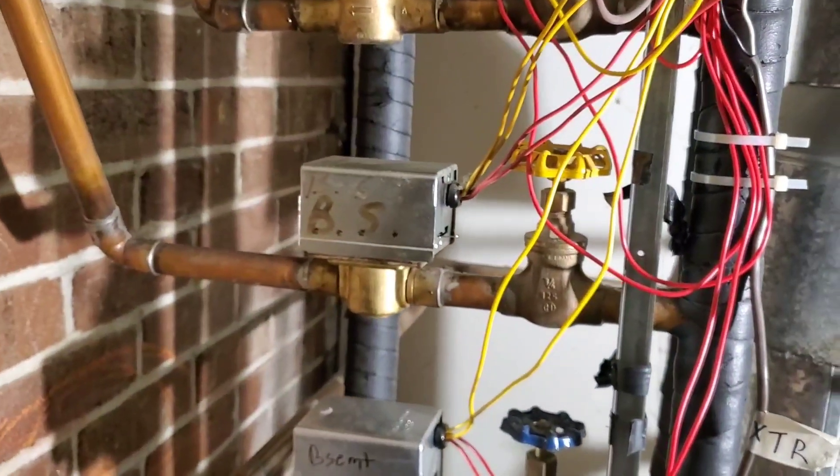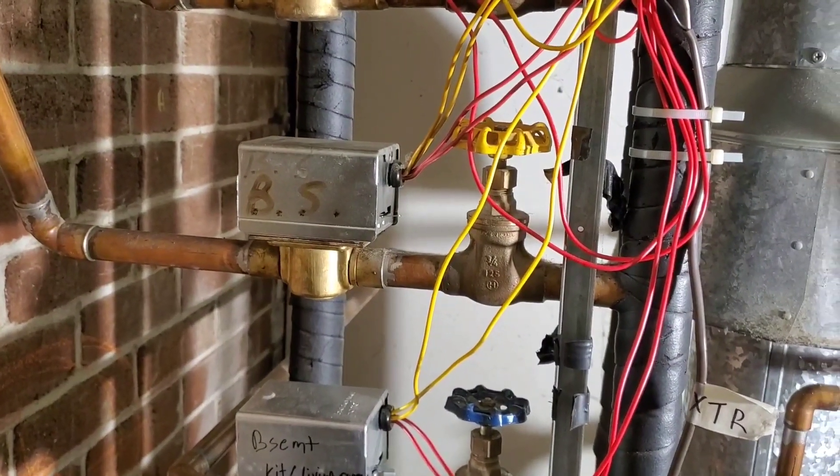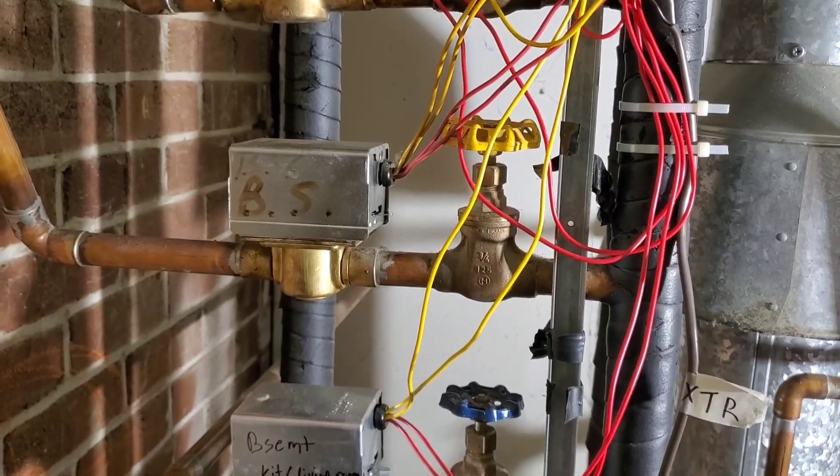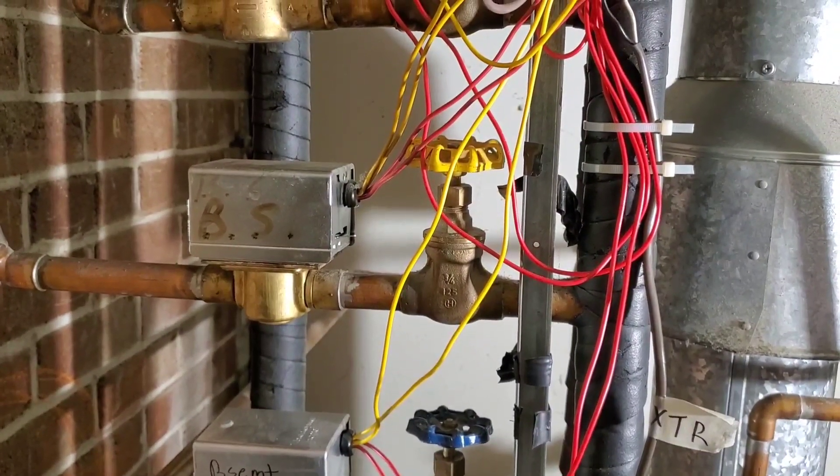That concludes the installation. I've installed a new thermostat, but if you ever have a problem where you're not getting power to a thermostat, it could be that you punched a nail through the wire, a rodent chewed through it, or some other physical damage caused a break. Because the thermostat is in the same room as the boiler this was really straightforward. If you have to go elsewhere in a finished house with drywall, just hide the thermostat wire behind baseboards or crown molding, or neatly clip it to the drywall. Don't overthink it — clip it up and try to make it neat and tidy.